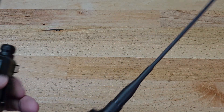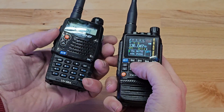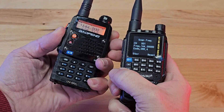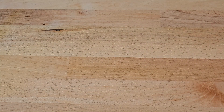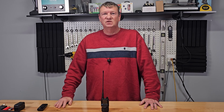The H3 also has one-key frequency match. While another radio is transmitting, you can hold down the 1 button on your H3 and it will capture the frequency, offset, and tone of the transmitting radio. Then you can store it in your radio. Since you can use this with any VHF/UHF radio, I can't wait to try this out at McDonald's.